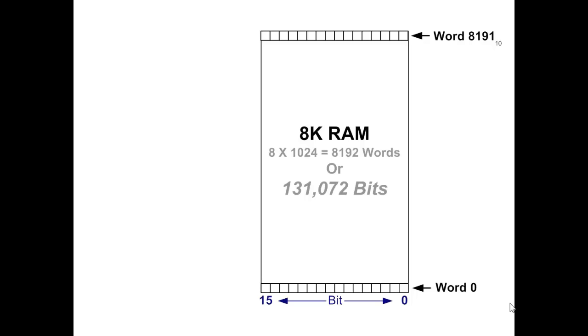In binary, the closest that we can come to 1000 as positional notation is 1024. In other words, multiples of 10: 1, 10, 100, 1000. But with binary, it's 1, 2, 4, 8, 16, 32, 64, 128, 256, 512, and 2 times that is 1024. For years now, the makers of computer memory have quantified their product in Ks of memory, or multiples of 1024. In recent years, the industry has strayed from this convention because the extra 24 elements really begin to add up when you get into mega and giga elements.